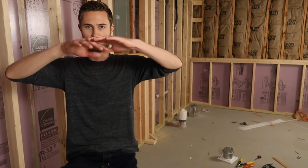The other thing that really absorbs sound is air. Even just a little bit of airspace between 2 resonating objects really goes a long way with soundproofing. That's why the whole concept of building a room within a room or floating a floor is a big deal. If you do that, then you've got a room that's vibrating or resonating as sound waves make it do, but because it's not directly connected to the outside structure, those vibrations and therefore the sound doesn't continue.